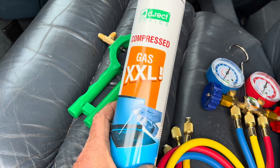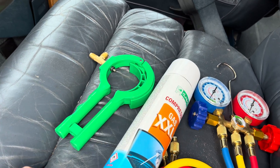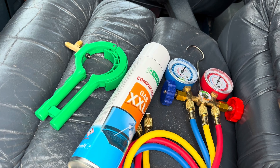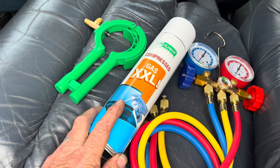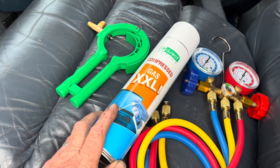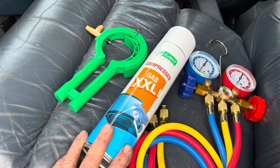And of course, our air duster, which as we've already ascertained, contains drop-in refrigerant for R12 systems and R134A. R152A does have a bitterant in it to make it taste horrible for obvious reasons, which is probably one of the reasons people say don't use them in air conditioning systems. But the dryer in the AC system of any vehicle will strip the bitterant out within a matter of seconds.